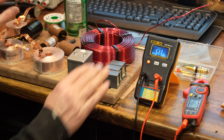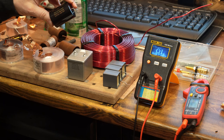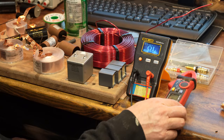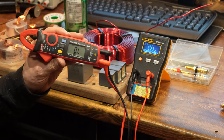Very expensive capacitors like the MCAP Supreme are 2% tolerance, but don't just trust what they tell you. Especially if you're getting old stock capacitors, you really need to test those — you never know what they'll measure. My favorite go-to tester is my multimeter — I've gone through so many and this one always hangs around with me. You can measure capacitance, voltage, current, and more. The other essential is an ESR meter — this is a MESR-100, not super expensive, around 60 dollars.